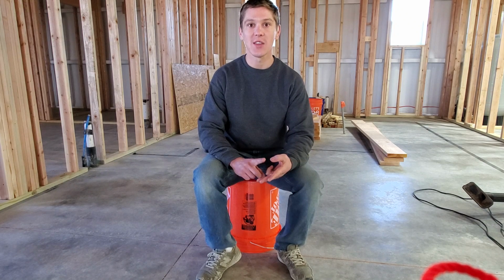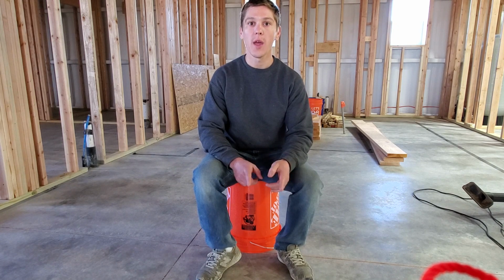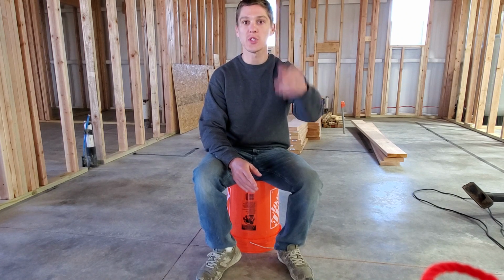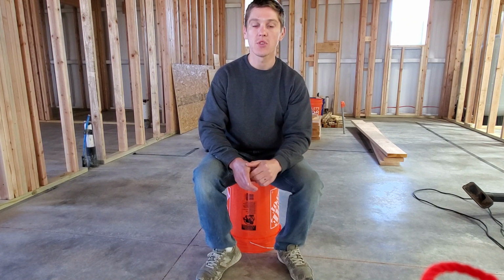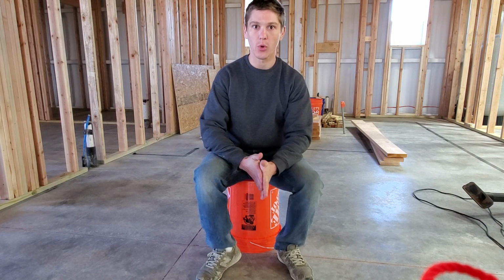And then the last thing that I'm gonna do, which I will do on camera, is we are gonna start working on the plumbing vent lines. So I got a bunch of 2-inch PVC and a bunch of 2-inch PVC fittings, and we are going to start routing the vent lines that go up, and then we'll run overhead in between the floor joists for the second floor and start running them all and tying them together so that we can have the stack, which will go up and exit out the roof.